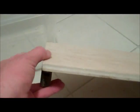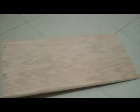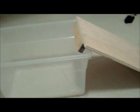The next step is to build a ramp for the tortoise to get up there. I already did this since I didn't want to stop the video again. Here's the ramp I built — pretty much just a single piece of wood with a little stopper attached so you can hang it onto the back and it won't slide off. Really simple to do: get yourself a flat, long piece of wood, cut it into shape, then put edges along it so the tortoise doesn't have trouble walking up. Pre-drill the holes so you don't split the wood, screw it on, hang it on there, and you're done.